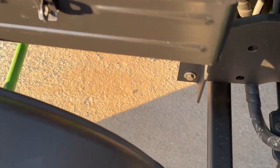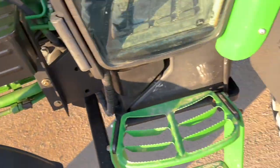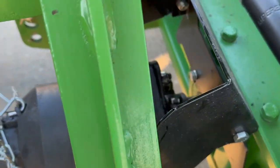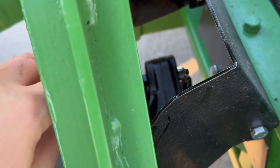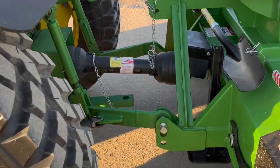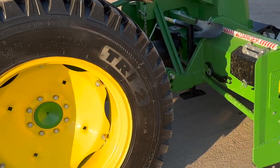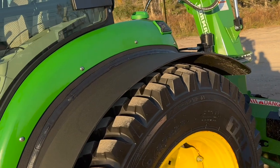That's everything you want to keep essential in your toolbox. Very simple, very easy — effective and efficient. If you look right in here, this cover comes up and you see that bolt running right through there — that's your PTO bolt. If you hammer some good snow or rock and the shear pins break and the PTO goes, I call it the two-for-one. You don't want to be doing that; it's quite something to change both. But it does happen.